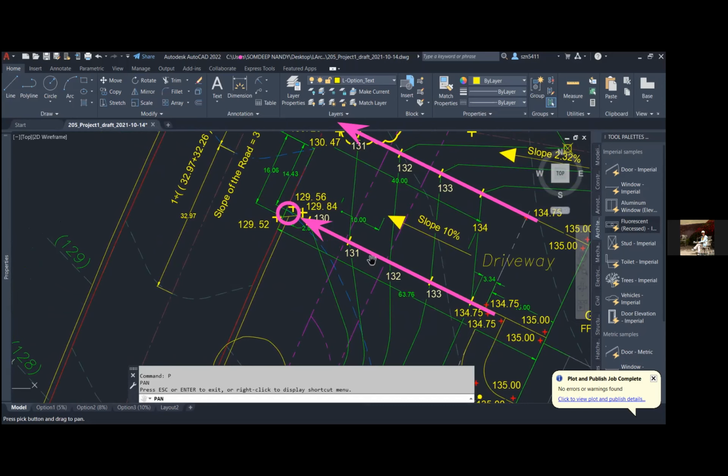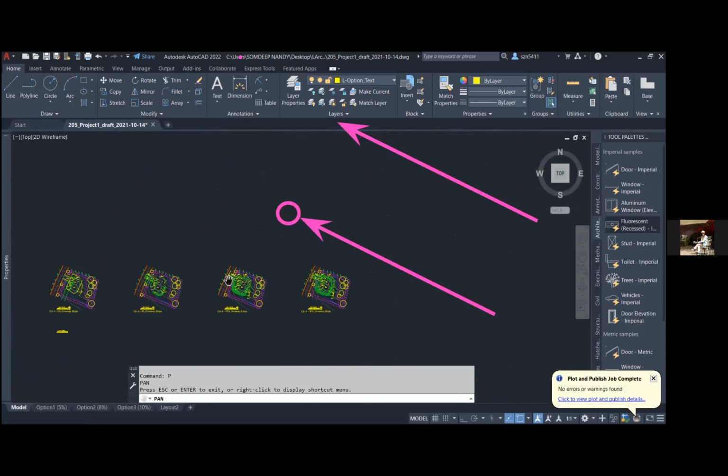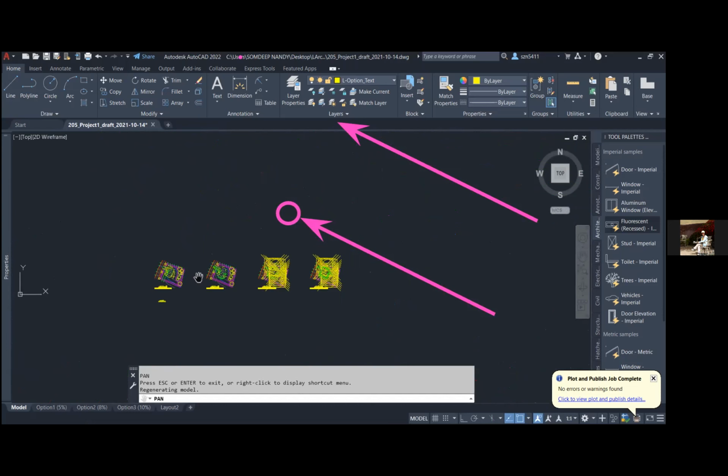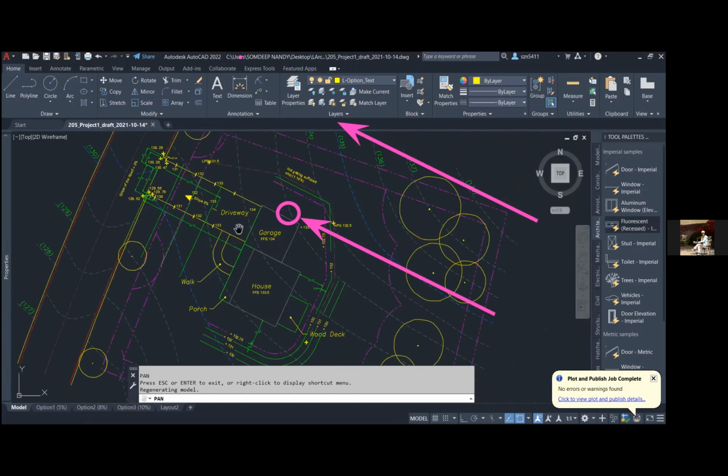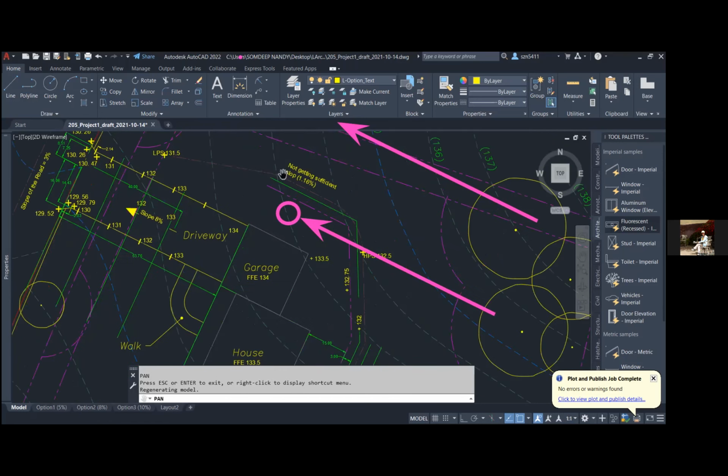Yeah. So I think your 8% solution might be the best one. Might be a safer one where no slope is exceeding 10. Yeah, 9% should work too, because it's a small distance. Because 8% is already not working, I think so. Okay. That's a lot of solutions. No worries. Yeah, this is 8%. I'm not getting sufficient slope for the soil.